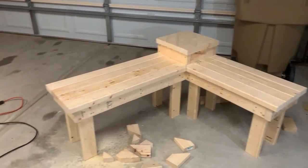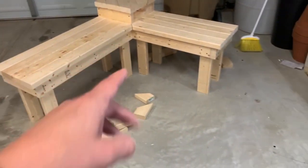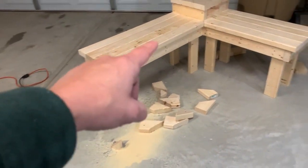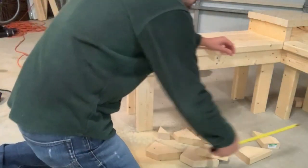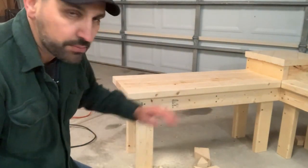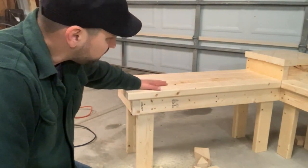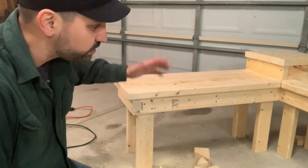Now all I have to do is connect everything down. I'm going to put some braces in between the legs just to give a little bit of added support — when people sit down they don't flex back and forth. So in between each piece we're going to do some cuts. I'm going to measure what they are and get them in. What we're going to need to put in between each leg is four seven-inch pieces that I'm going to cut using some scrap two-by-four. Once I get that done, all I have to do is secure the tops of these seats, sand it down, secure the seats, and then stain it all up and we're done.